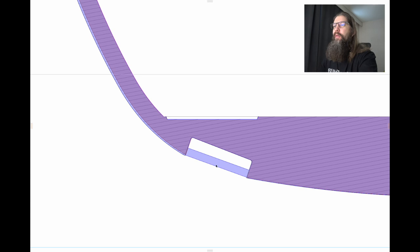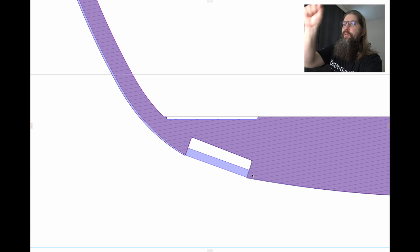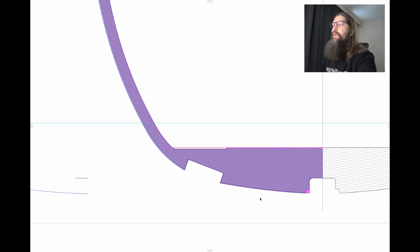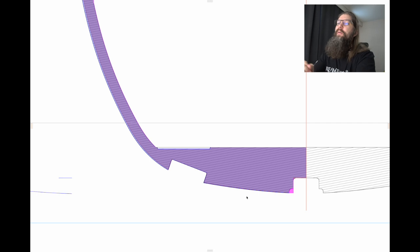But on the other end, I'm going to have continuous structure at the outer edge of the frame. I didn't mention that the keel timber will be laminated as well from thinner pieces of wood, so I can insert the thinner pieces through this hole and on the top side it will just be laminated. That way I can get the structure continuous here. But the other thing about these middle frames is that they are very, very big.